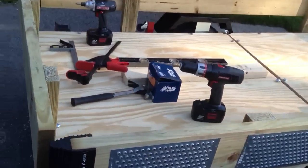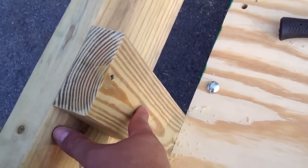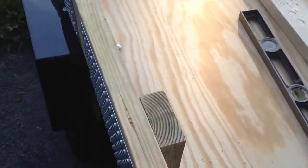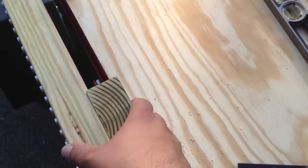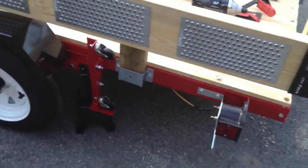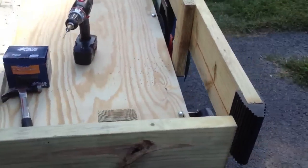What I have to do now is board these out and put some real bolts in there — some stainless bolts because this is pressure treated. And I have to do that on each one of these vertical posts. I just put a regular couple-inch screw in here just to hold it on there, so I could get it all set up and level. But now I have to actually do the real fastener, which is the bolt.